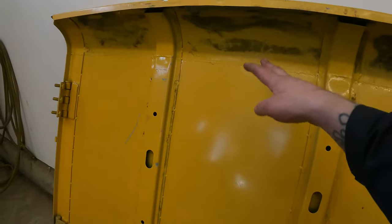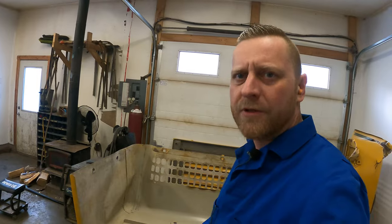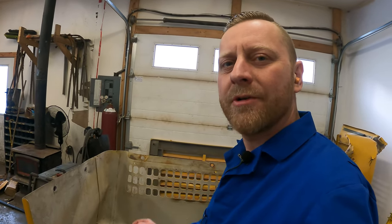I just used the original top and the braces and re-skinned from the curve down. The first panel we'll start off with is this corner hood panel — this is probably the easiest out of the bunch so we'll hammer it out quickly. This sheet metal is 14 gauge, which is a lot thicker than what I'm used to.